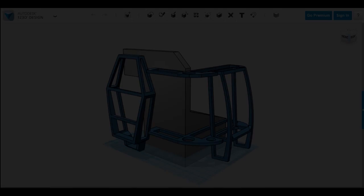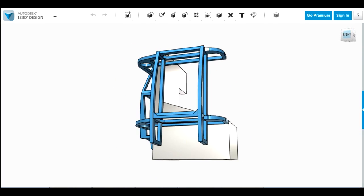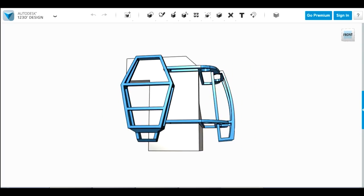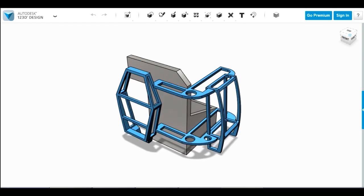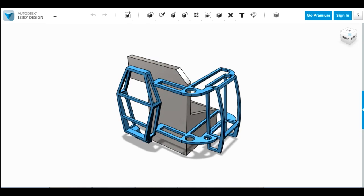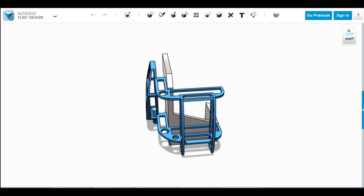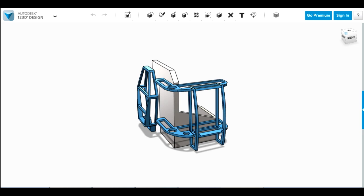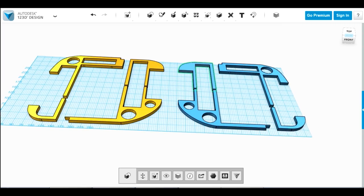Let's have a look at some CAD for the pieces that link this together and mount them onto the thigh. The silver piece in my CAD is a crude representation of the frame so I can work out how to position parts. The blue parts are the frame — you can see the front and back parts I've already printed. That leaves two new pieces to print which will have screw holes to screw onto the wood and hold the other pieces in place. These are the main brackets to get a feel of what it looks like — and I've split those in half since they're slightly too big for the bed.